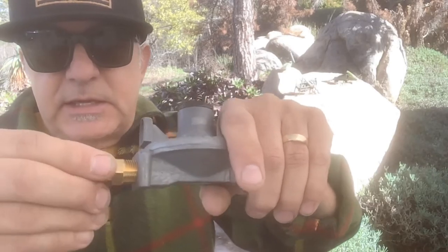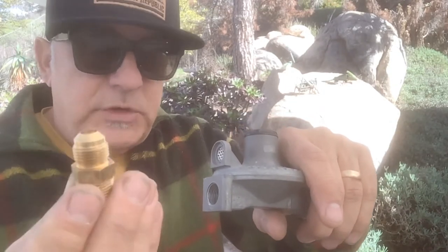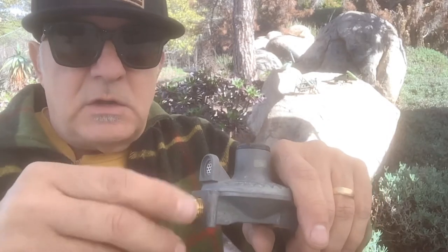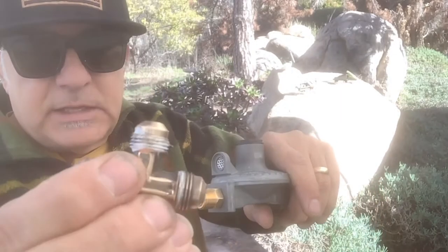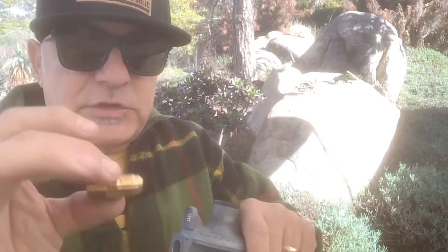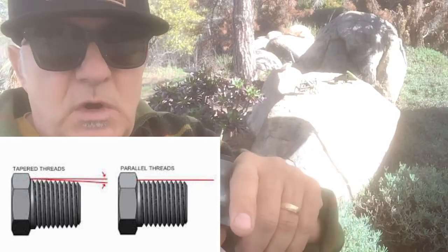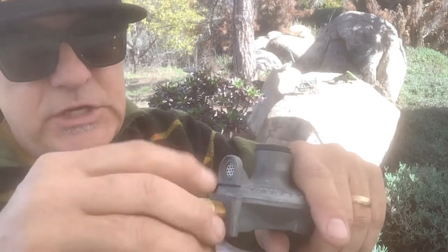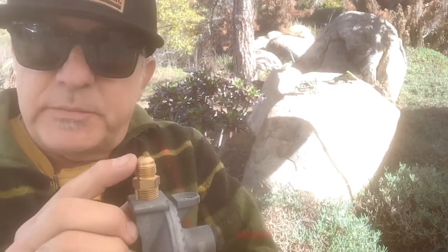You've got to be careful because this side is a compression fitting, but it's also three-eighths and will fit in here fine too. You may have done that with a bunch of tape on it — that's all wrong. Even though these are both three-eighths threads, they're not the same: these are tapered and these are parallel. So you only want to put the pipe thread side in here, otherwise you're going to get leaks — it's dangerous. So then we're going to tighten this up, and now we have a compression fitting here.